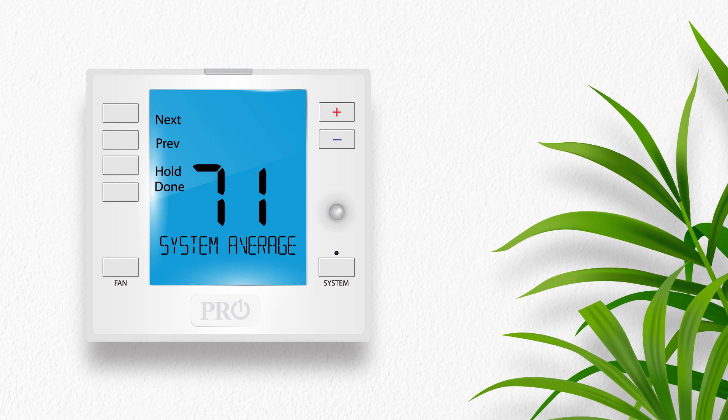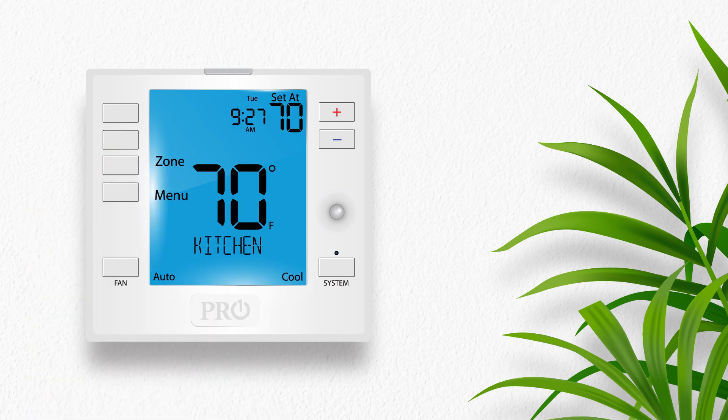Finally, if you want to use a specific remote sensor to control the system, you can use the zone menu to select a device. In the menu, use the next and previous buttons to cycle to the specific remote you want to be used for control, and press the hold button. If you have the schedule turned off, the selected remote will be used to control the system by default. If you have the schedule turned on, the system will start a 4-hour temporary hold with the selected remote sensor used to control the system. After the update, the name of the remote in control should appear in the text field of all remote sensors. It can take up to 5 minutes for the update to appear on all remote sensors.